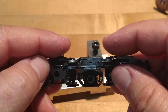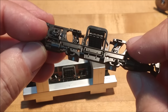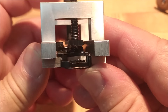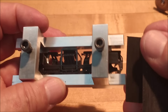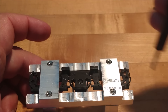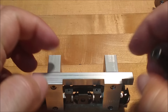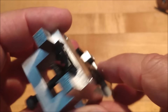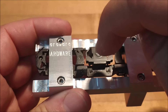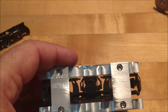I am registering these pieces on the top of these little hydraulic cylinders here, and that is going to bring me true to the world. The pressure coming from the screws is registering against what I'd call the axle caps or bearing caps. Right now I have a Delrin shim over top of that so I do not mark the part. I'll ultimately make precision shims that slide in here like a drawer and locate without the fiddle factor. I can sit it in the vise this way for the milling operation, then stand it up and the holes present themselves perfectly with plenty of room for the countersink tool and the drilling operation. That's what I call an upside-down fixture — you put the part in, turn the fixture upside down, and there you go. The part is not pressed down against any registration surface; it is being pressed up and the whole fixture is pressed down.